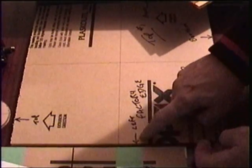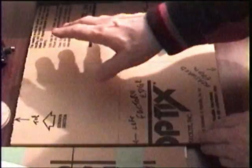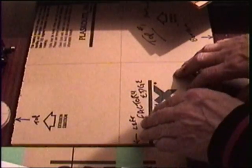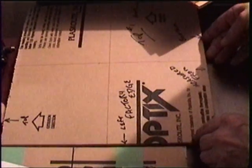You'll see here I have the left factory edge. When I bought the plexiglass, I marked off which were the factory edges. When you're doing any kind of fitting — I used to be a steel fitter — you have to know where the factory edge is, because after somebody cuts something it may deviate somewhat. So I mark off what's a factory edge and then I measure from that factory edge, not from where I've cut.